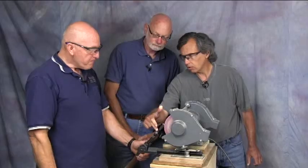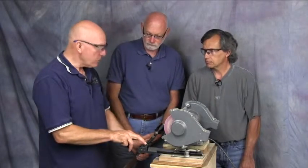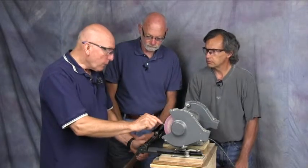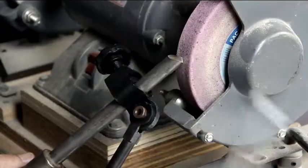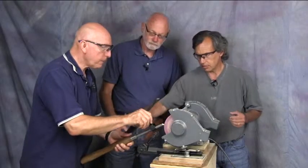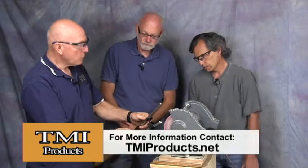So you didn't have to change that hole or the collar? No — the collar, once it's initially set up, should never change. The shape is shorter on this one simply because we've changed the bevel angle so greatly. The other tool is more swept back as well as having a steeper angle, and a lot of folks like that long swept-back angle.